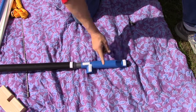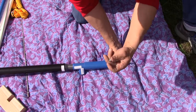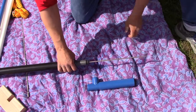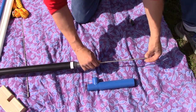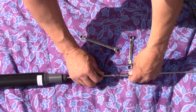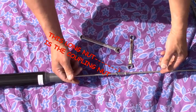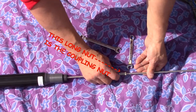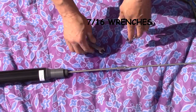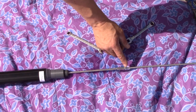The well head is shipped attached to the pump to protect the exposed piston rod during shipping. Remove the nut at the top of the well head — do not lose this nut — and unscrew the well head and remove. Now replace the nut on top of the piston rod. Attach the first pump rod to the piston rod coming out of the pump, being careful not to cross-thread the rods. Thread the rod all the way into the coupling nut until rod hits rod inside, then spin the jam nut up to the coupling nut and tighten with two 7/16th wrenches. There is no rotational stress on the rod so snug is all that's needed — not superman tight.